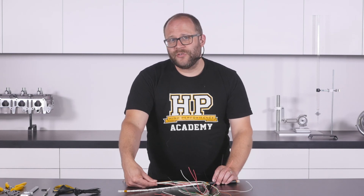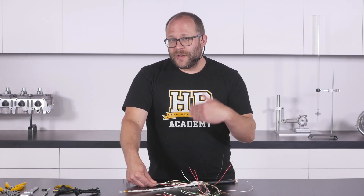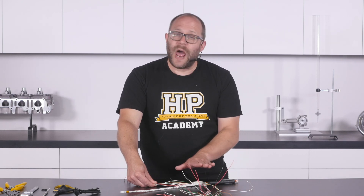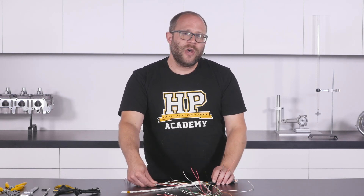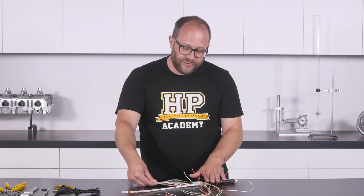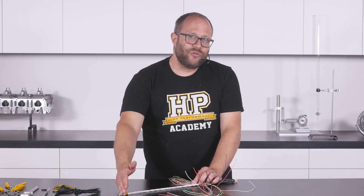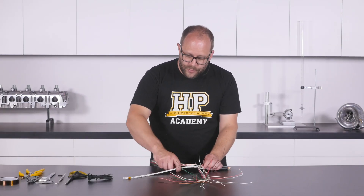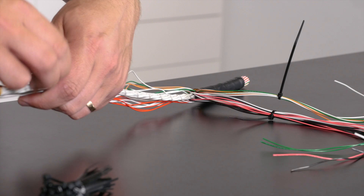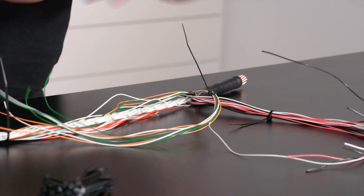Of particular note in that design is that our 22 gauge wires are no longer in layer two of our harness — they're in layer one. They've moved down a layer, which means their direction of twist is going to change as well. This is what we meant when we talked about branch points being nicely strain relieved points that we use to make the necessary changes to our harness construction. This is where we can change the twist direction of these wires as tidily as possible, then ensure the harness section heading off down the main trunk is going to be uniform along its length. I'm going to cable tie the rest of our wiring tidily out of the way, along with our main harness core, and then get back to our branch points to sort them tidily into their individual branch sections.